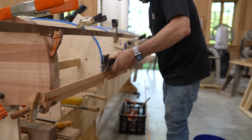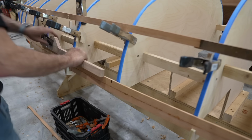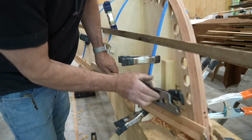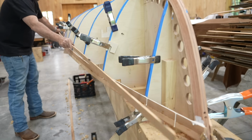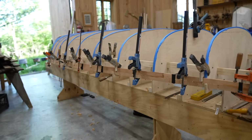And now you see here with this hand plane, the shoulder plane, works better on the pull than on the push. I can control it. And that guide has like a bullet. Well, not yet. You see, it doesn't have the bullet nose yet because every time I use it, it kept banging my knuckles. And then I put a bullet shape on the end so it doesn't keep hitting the stations. And the way I attached that piece of wood to the shoulder plane was with CA glue, which just breaks right off later on.